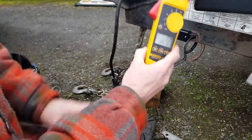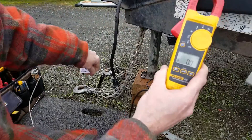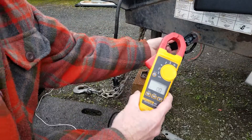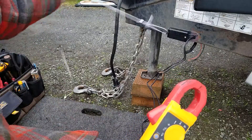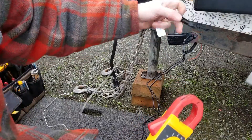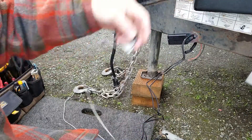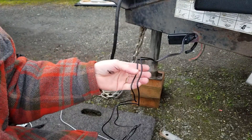Plugged in — nothing. When I pull this out, zero resistance. So this is nothing more than a switch, really all it is. Instead of a toggle switch like in a house, when this pin pulls out there are contacts inside, and this plastic piece keeps those contacts separated. When the pin pulls out, they touch, thereby connecting the two wires. Why is that important? We'll get into that next.